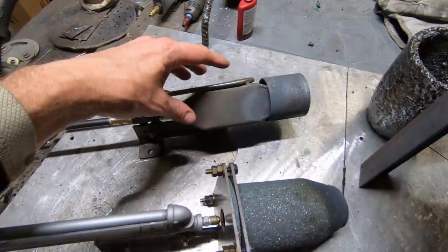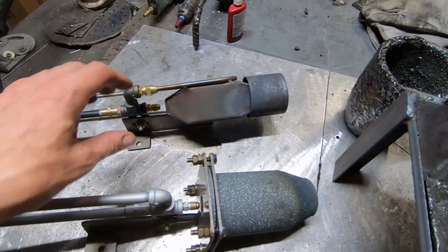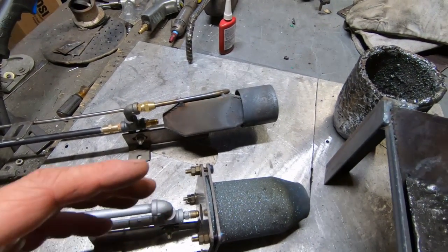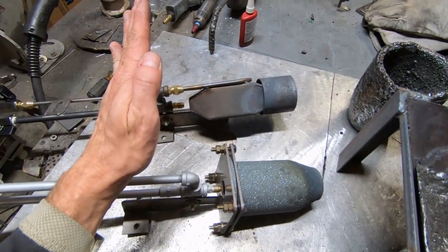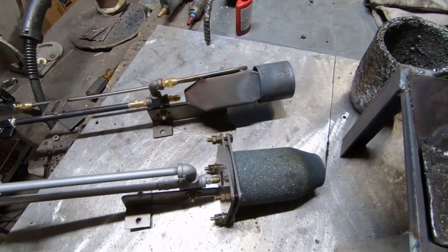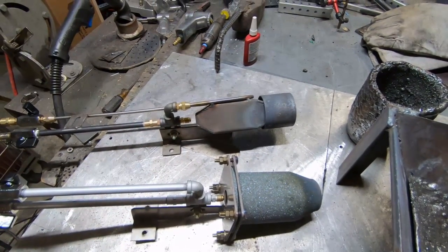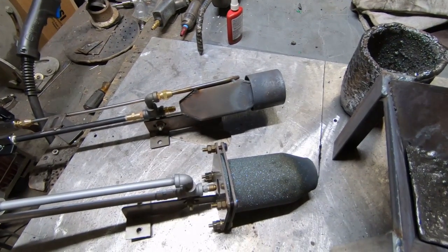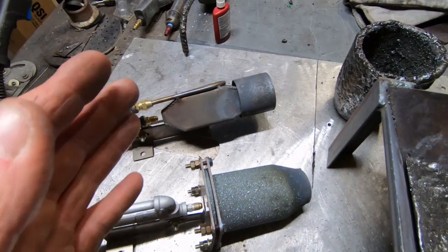One of the reasons that's important is when this chamber is glowing red hot, as we see in some of those clips, the second that fuel enters in here it's almost instantly vaporized by the infrared radiation. When you put your hand by this thing, it'll burn your hand off. The fuel that's spraying out of this thing — it's being atomized, it's being bombarded with that high-energy infrared heat, and it's being vaporized much more rapidly. I believe that's one of the reasons that attribute the higher temperature.